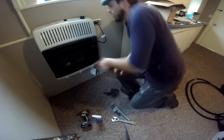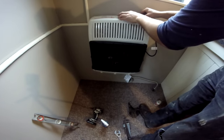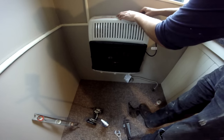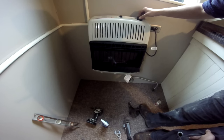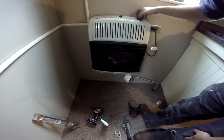We're going to plug this in now. We've got gas — we bled the gas so there's not too much air in the chamber. The instruction manual told us there's a battery, and the battery came with this model, so follow your instructions. Screw that back down and it sparks. So now we'll change it from off to pilot, depress the pilot — you'll hear the gas hissing. Wait a second for natural gas to go through the valve. There we go — moved all the air out, air is pushed out, natural gas is ignited. Wait for the thermocouple or thermopile to recognize the pilot flame. After it hits a certain temperature it will click, your pilot will remain running. Let go of the pilot supply and it stays lit.